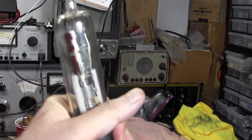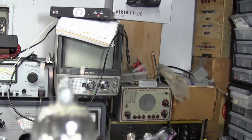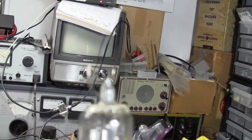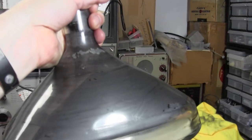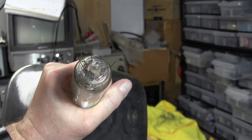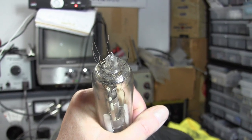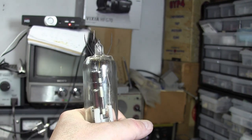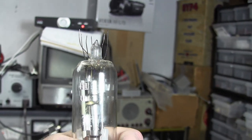I am throwing in the towel for now. I've tried everything I can think of - I cannot get any emissions out of this CRT. I've tried connecting the leads in different ways, sanded them down to bright copper, and I cannot get any emissions whatsoever. I think I have the smartest viewers on YouTube, so maybe some of you have an idea of how to resurrect this CRT. I'll leave you with some old footage of when I did successfully re-weld a cathode. Thanks for watching - if any of you have any thoughts on what's going on, I very much look forward to reading them.